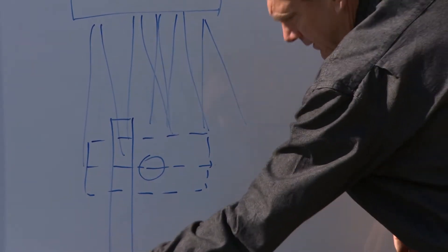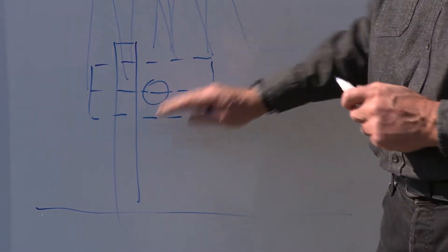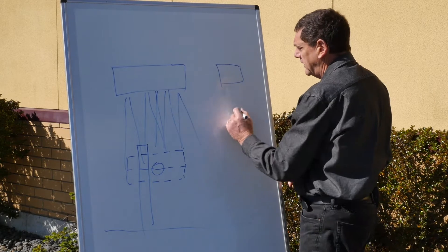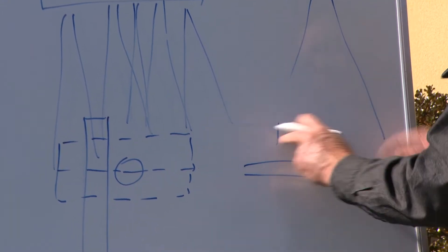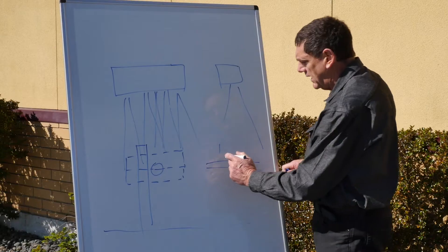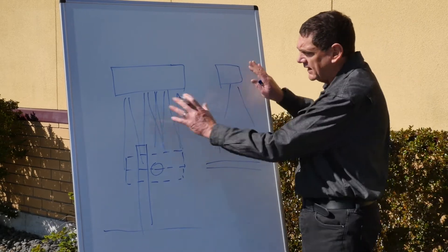Also, if your ground is down here, you have to remember that the ground can't be in the control zone — nothing can be in that control zone above or below the string. You've also got to remember that the beam comes out wider as well, so when the string is running along you've got to look beside the string. If you have something beside the string, it's going to interfere. Those are the things you just have to remember when setting up a sonic.